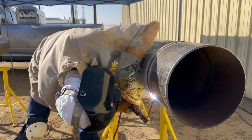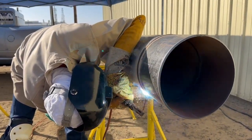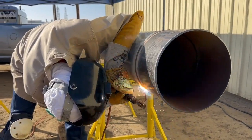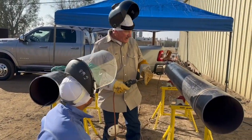If you're new to this, you will get down there to about 4 o'clock and you will start going the other way. You'll get a little frustrated, so you'll start running away from the puddle and start welding down the center of the bevel, but you'll leave it a little low, then you'll cap it and be low.